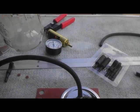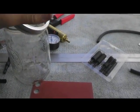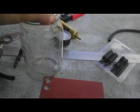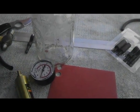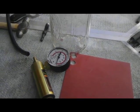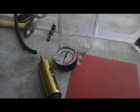Basically, I'm going to use this mason jar together with my hardening liquid inside it with my knife scales. Then I will close the jar and attach the pump on this side. With the actual wood hardener and pieces of wood inside, I will pump this until I get to 23 mercury units and then watch the replacement of the air as the air boils out and the actual hardener goes into the material.